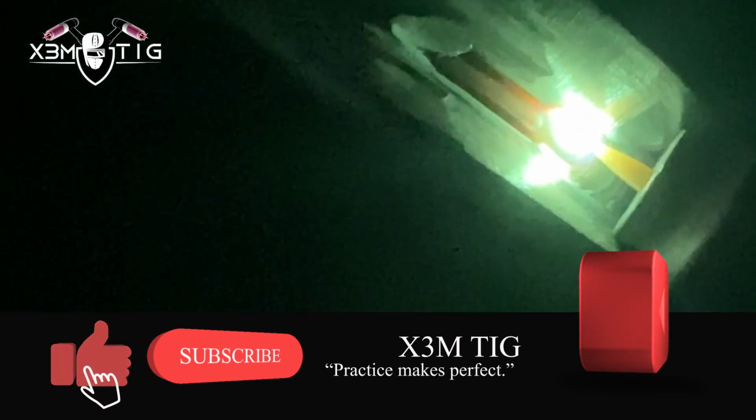I'm always keeping my rod inside the bevel when I'm going on my way up at 9 o'clock. Now before we get to that tack, I'm gonna pull the rod out. As you can see now, I'm holding it inside, doing constant feed. Constant feed is just keeping that rod inside the puddle all the time. Okay, now I'm gonna pull the rod out.